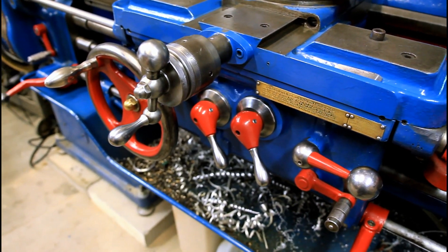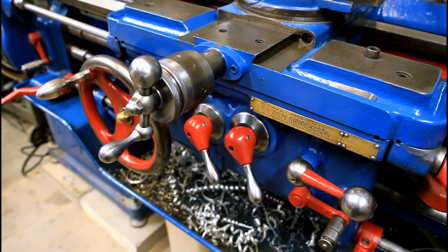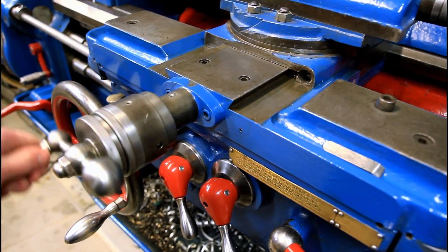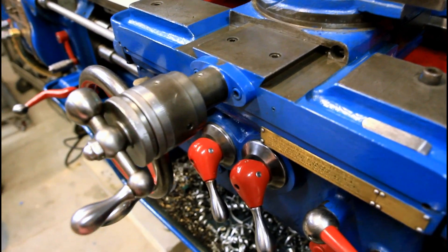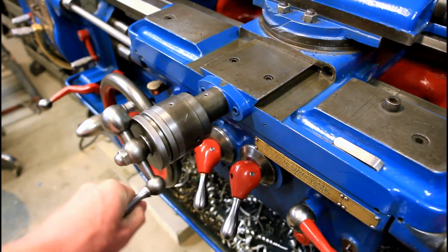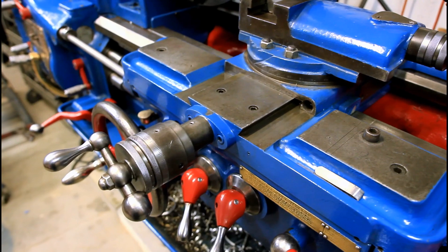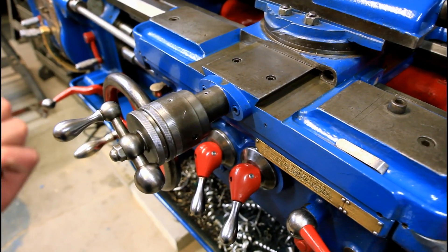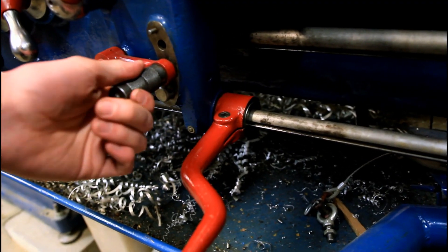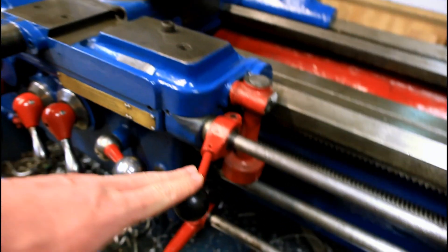This lathe has a well-optioned apron. It has individual feed clutches instead of a combined one, and you are able to engage both of them at the same time. Also unusual is that on most lathes, when the carriage moves to the left, the cross slide would normally move out. That is not the case with this lathe — if you engage them both together, you will see that it moves left and in. That's a pretty unusual feature. This one does not have the option to swap direction via the opposite side of the bevel gear — it's blocked off because they instead expect you to use the lead screw reverse.